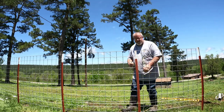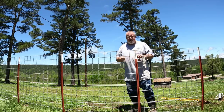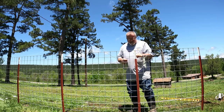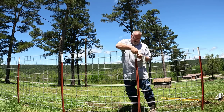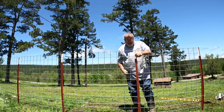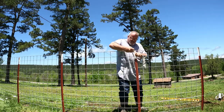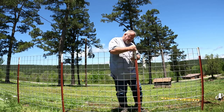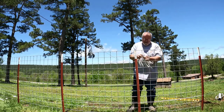I'm just getting the first fence panel up using these fence clips. Generally you can tell if your T-posts are level by going off the fence — sometimes you've got to move them. The nice thing about these panels is they're easy to install and stay pretty tight. I put that one upside down because of where it was. All you do with the clips is take your needle-nose pliers and pull it around — they ain't going nowhere. It's a little easier than wiring them. I'm just trying to get the tops installed first, then I'll come back and get the bottoms.